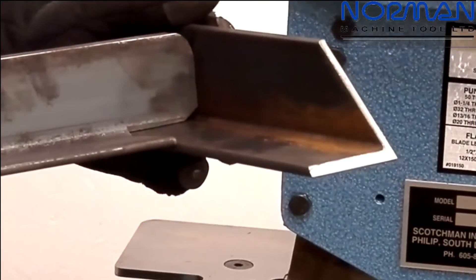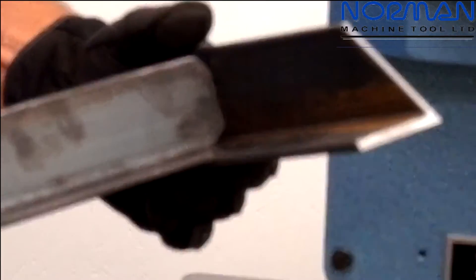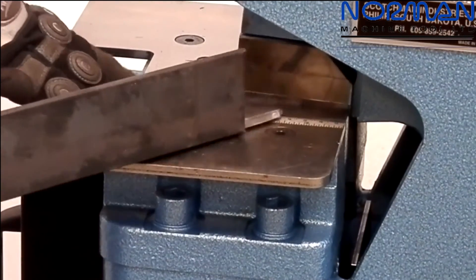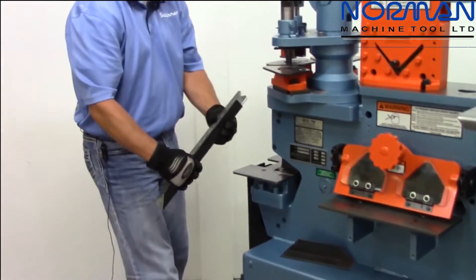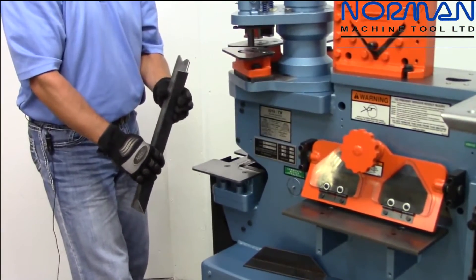And there's your butt joint. That's a popular fabrication option for a lot of people making frames. However you stick your material in there it will nibble it off — if you need to trim edges, cut a certain angle, you can do those operations with this notcher without worrying about side-loading it.